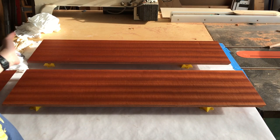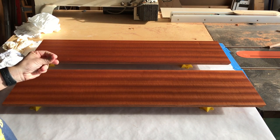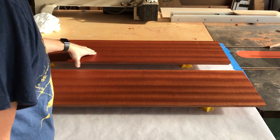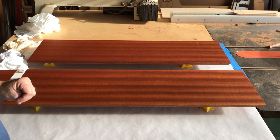Actually, even when you're doing the first coat, as soon as you wipe off, you can basically touch the wood. It makes like a little bit of a film on your fingers, but it's not going to actually harm the finish at all. Another benefit — the wiping on and wiping off. So that one's good.